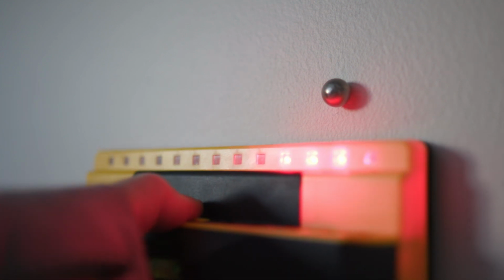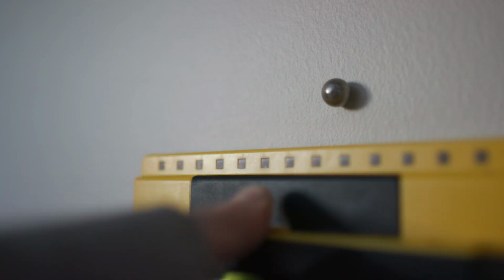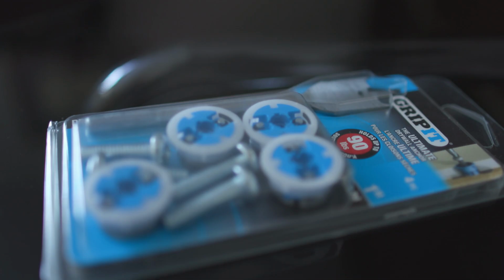That meant the one on the right was going to have to rely on some drywall anchors to stay in the wall. I found some drywall anchors that had a 90-pound rating. The ratings really don't mean that much. The ratings really indicate how much gravitational force you can put on the anchor. But in the case of a cabinet structure like a Trones, there's going to be gravity acting on it based on how much weight is inside of it. And there's going to be your hand grabbing and pulling on the front door, excited to play Donkey Kong Jr., adding a different kind of force. So you're definitely not going to put 90 pounds in these just because the anchors say they can take it.